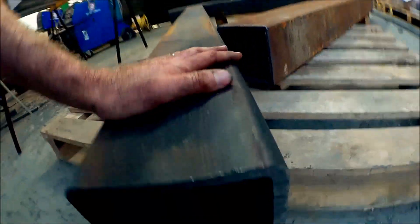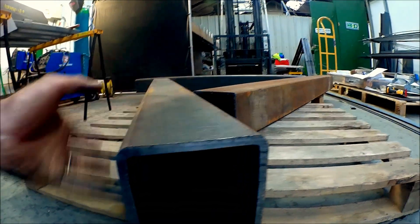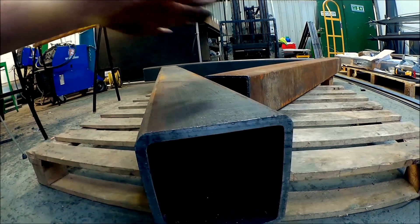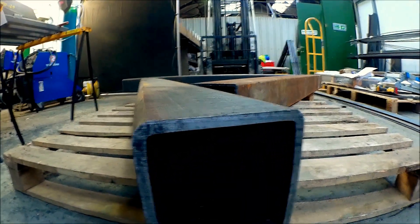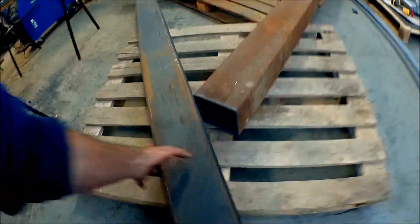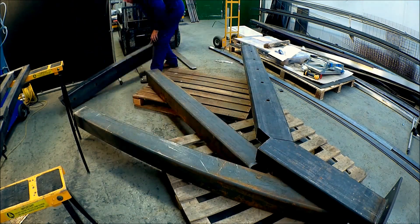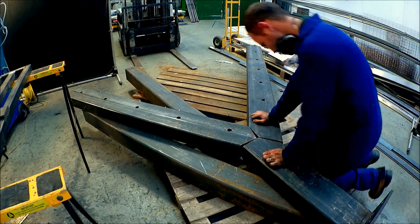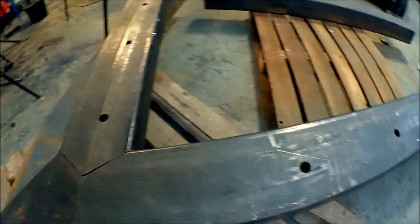All of these are reasonably flat and the same dimension, so when I clamp to them they should hold everything nice and rigid for when I weld. When I do weld the frame together it's not going to bow or twist because these big pieces hold it nice and straight. With a bit of jiggling around it'll all fit together nicely. All of these bits were actually laser cut as well, so everything is really precise — those measurements and angles are exact.